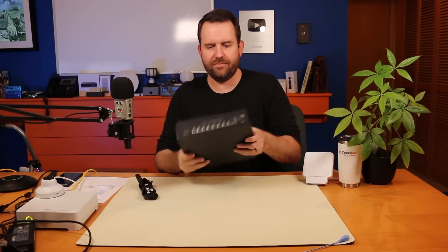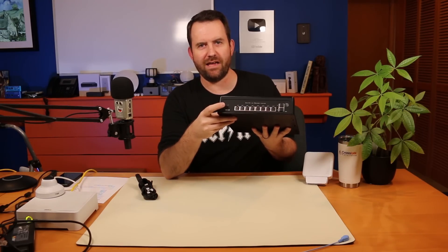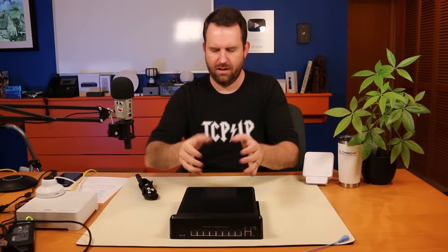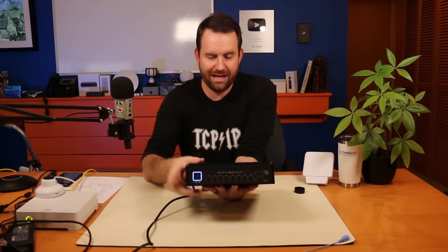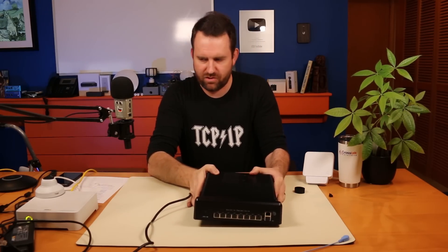I'm going to plug this in and get it adopted into UniFi. I don't see the standard UniFi LED, although there is a little Ubiquiti U right here, so I'm guessing that's probably the LED — let's plug it in and find out. There's the LED; it's actually surrounding that little U logo, you can see the square LED right there. It's times like this I'm very glad I put a second circuit in my office. I'm going to pull out one of the uplink ports and get this plugged into another switch. We have a solid white LED, which means this switch is ready to be adopted into UniFi.